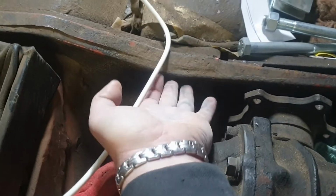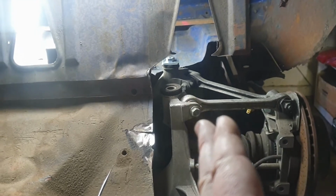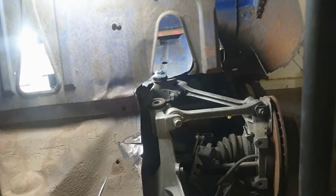And then we did another double check from inside the car. We used the front face of the rear seat, came up to create a datum. From there back to that same bolt at the back to make sure everything's square left and right. So now that we've got everything located left and right, a simple Tek screw into our jig to locate it on both sides so it can't move forward and back. We have tabs down the side so that we've got it all located.